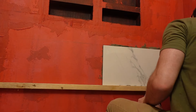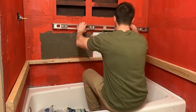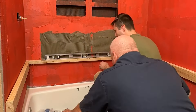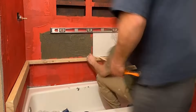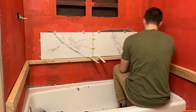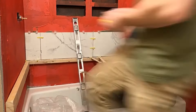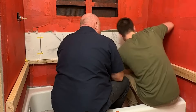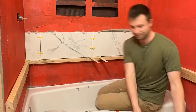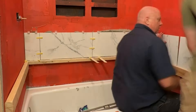Getting the first tile up was a huge success. We laid the tile across the foundation row using those two-by-fours that we'd later remove. We actually removed the tile a couple of times because we couldn't get it level, even with the boards. We put lots of shims in there because the walls aren't perfectly level in this older house. So it came with all sorts of complexities, but just know you can do it — it just takes a lot of patience and time.